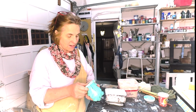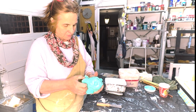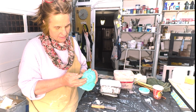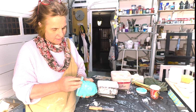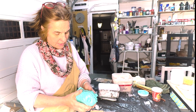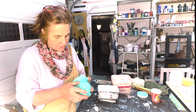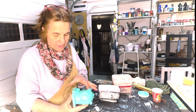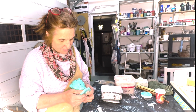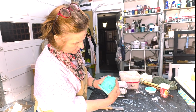This is what our rubber mold looks like now. We've drawn a line where we intend to just do a cut, and we're hoping we can just peel the whole mold off and then put it together again. But because it's quite thin in places, we have to have a casing. So I'm trying to simplify this mold into a simple 2-piece mold.